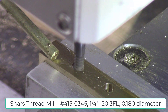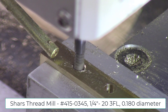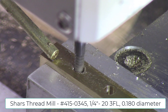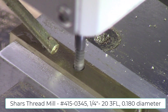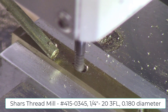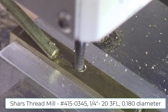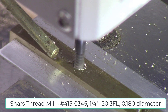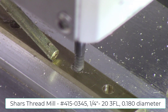The second step is using the thread mill to form the threads inside the pre-drilled holes. The tap goes around in a circular pattern as it comes up in the Z direction, forming the threads. We are doing a double pass — pass one does the initial cutting and a second pass cleans up the threads to give a finer finish. This is a quarter inch, 20 thread per inch tap, and the actual diameter of the bit is 0.18 inches.